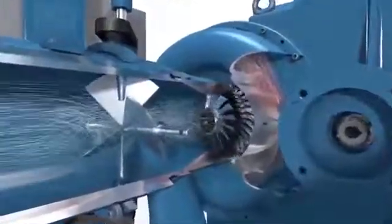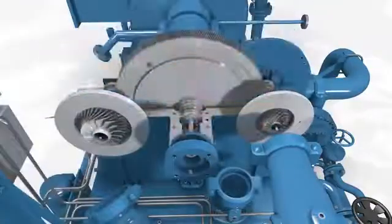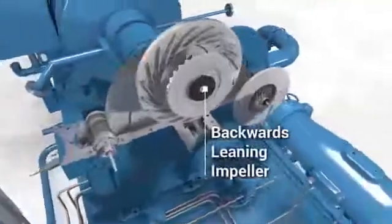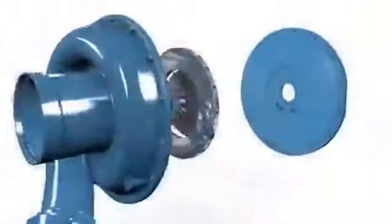From there, the accelerated air or gas stream flows from the first-stage impeller to a radial diffuser, which converts the air's high velocity into static pressure before the heated air enters the scroll casing. To ensure perfect aerodynamics, FS-Elliott will custom design both the backward-leaning impeller and radial diffuser for your specific application.